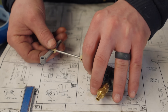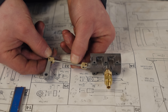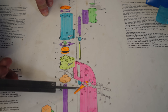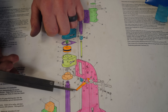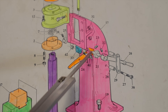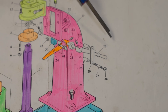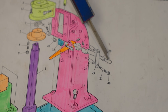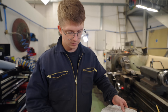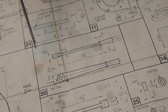That's going to be attached up top to our valve piston. What we've effectively just made is the linkage that allows us to control the valve from lower down on the machine. That arm — part 24 — it's going to be poking inside the body of the casting and affixed to a pin. In order for the operator to control the steam hammer from back here, we need another handle — part number 20 — which is a little more ergonomic. That's why they gave you so much material, because you make that out of it as well. It's made out of the exact same bit of flat stock. Part 20, coming right up.